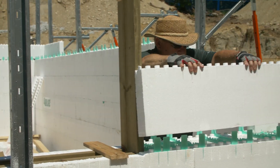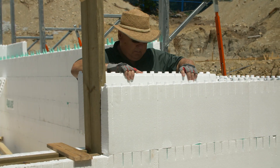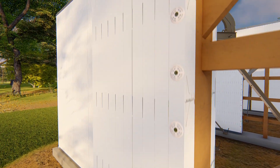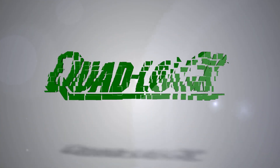When the buck-out is positioned and braced, continue stacking the wall. Lap the EPS panels over the wood so panels can be fastened securely with screws and windlocks after the walls have been completely stacked.